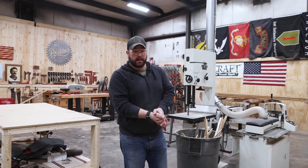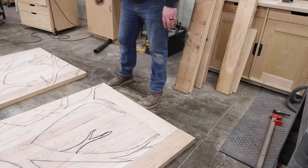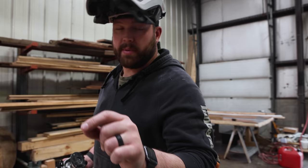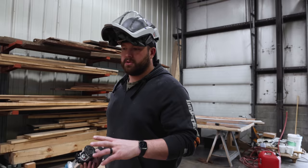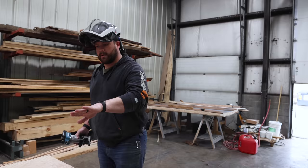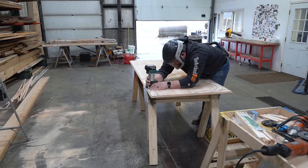We're gonna take the door apart - it now has a tree that kind of resembles a tree drawn on it. I'm gonna carve the interior panels first. I'm going for a look on the edges where they die into the stiles, and then I'm gonna cross over in the center of the tree. Because I've never done anything like this before and this needs to actually look like something, I'm going to start by outlining it with a bullnose bit at about a quarter inch depth. It'll set the depth of what I'm gonna carve to.